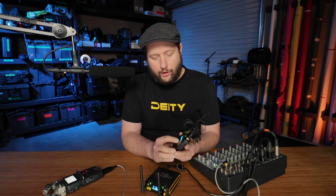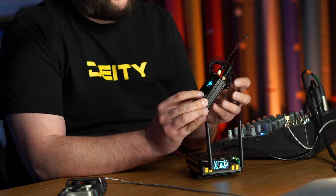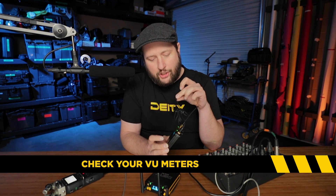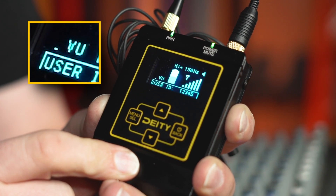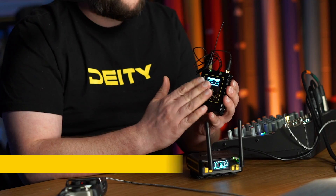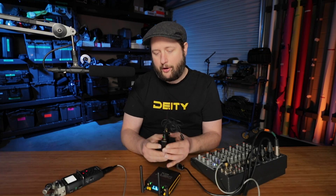What you're going to do is talk into your microphone until you can see that kind of scale. Just go back to your home screen, talk right into the microphone, and you can see we're getting some pretty decent bouncing audio. For this particular transmitter it's +15 dB — some need to be at -12 or -18 depending on the brand you purchased. You want this to be kissing right at the top before peak. That's how you set up a transmitter.